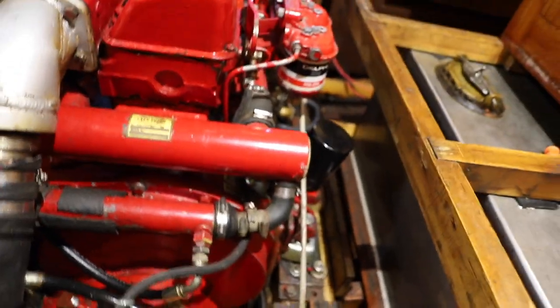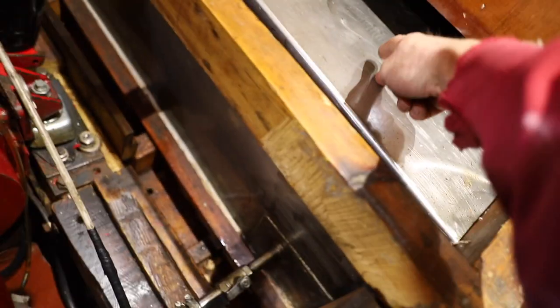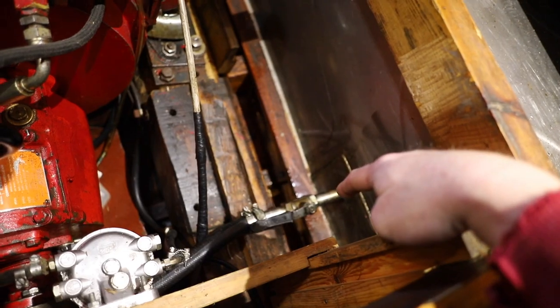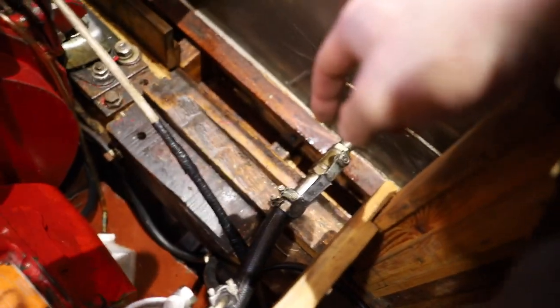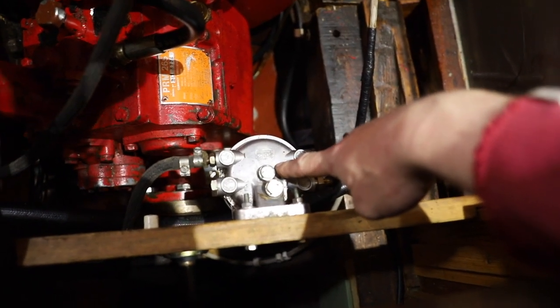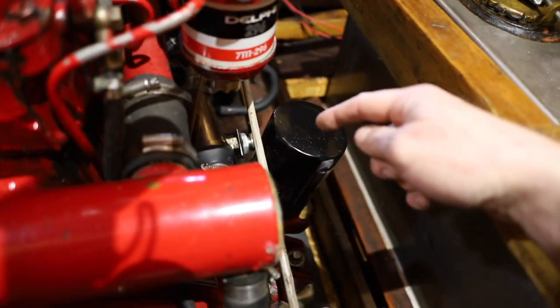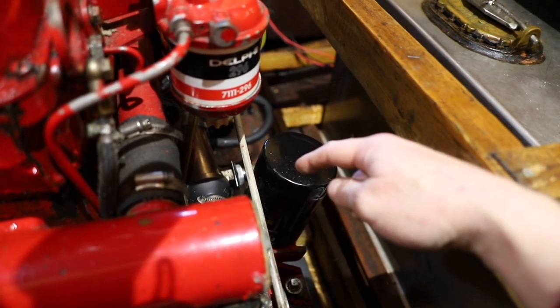So again, I'm gonna run you through the process. So here's a fuel tank, and there's a fuel tank. And nowadays you cannot do this anymore, but you should have the fuel outlets on the top of the tank and not on the bottom. But here we have them on the bottom still. And first of all, the fuel comes from this hose and it goes into this filter over here, and I have the new filter there, and from there it goes down there somewhere where the fuel pump is, the low pressure pump,